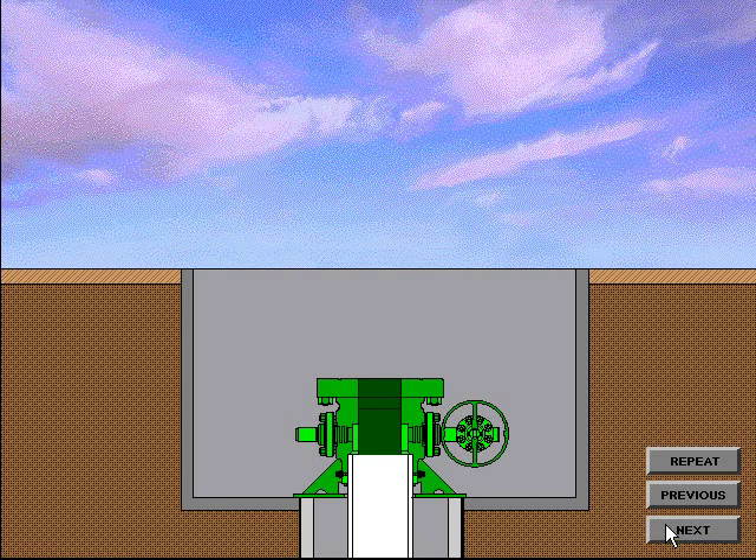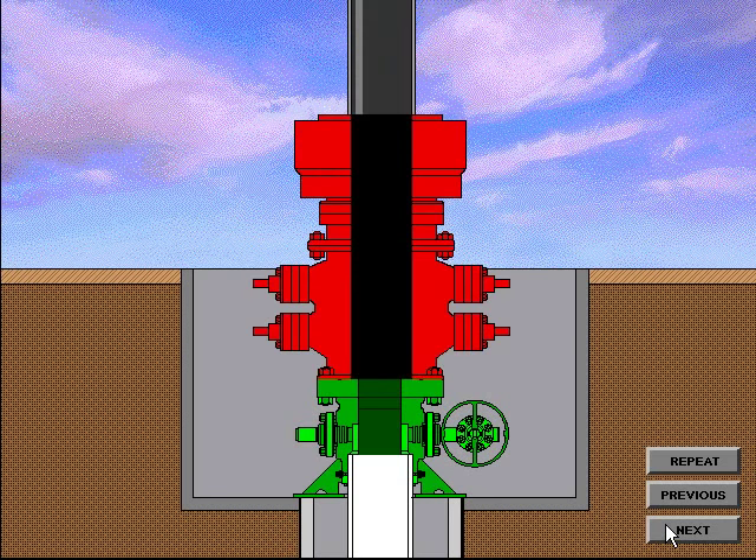When the casing head housing has been successfully welded and tested, the BOP system is installed, or nippled up, and preparations are made to drill out for the intermediate string of casing. To test the BOP system, the test plug is made up on the drilling string until properly located in the casing head bowl. Pressure is applied from above the plug and the BOP system is tested. Upon completion of the BOP tests, the wear bushing running tool is made up on the drill string and the wear bushing installed on the running tool. The wear bushing is then lowered through the BOP system until located in the casing head bowl. The wear bushing is locked in place either by lockdown pins in the casing head housing flange or by lockdown pins located in a lockdown flange.